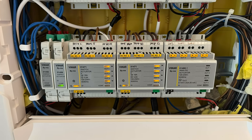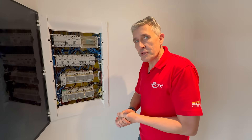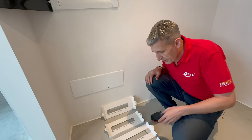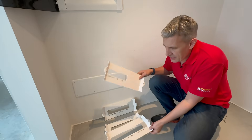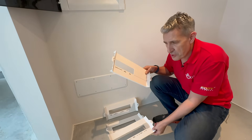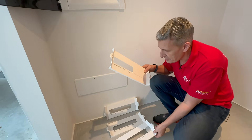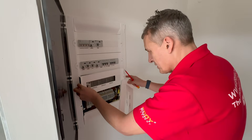This has got air conditioning and an air source heat pump, but each room seems to have its own little thermostat wired back to this control. There seems to be some control comms wiring underneath going back through those conduits to probably another junction box. I like the modular plates on here — there's only one problem: I can't necessarily remember which one goes to which row. Not ventilation, that's lights.